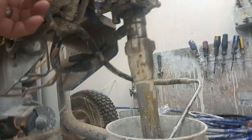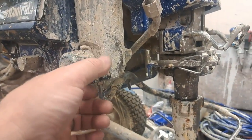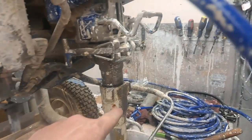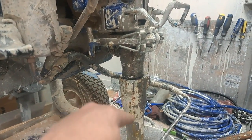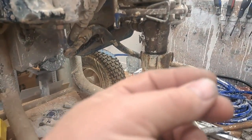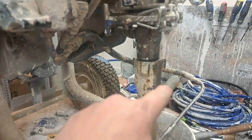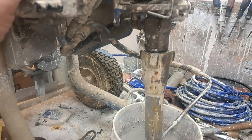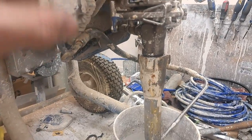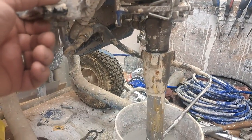I'm activating it manually, by the way. The reason you do that is you want that ball to move so it hits on different places to make sure the ball is good. If you have a bad spot on the ball and it's not over the inlet valve, you'll hold pressure — but as soon as it dumps off, that ball moves and you get different areas hitting, exposing the bad spot.